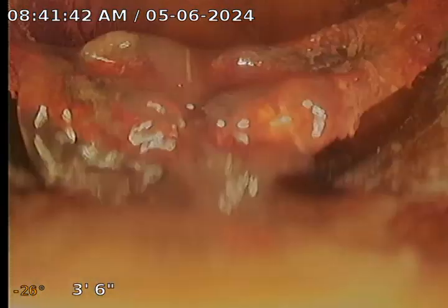Pulling back out — nothing concerning here, just older cast iron pipes. Keep that clean-out so you can do maintenance when needed. Now I'm turning down and pulling back toward the city street. We're in PVC right here — looks like some new PVC piping. Clear. This is newer, dropping straight down, making a good turn. Still clear — this is all newer where they did some work.